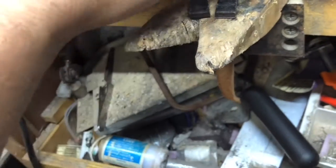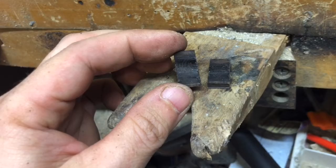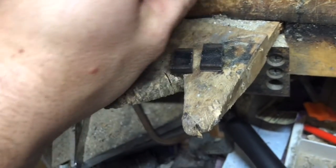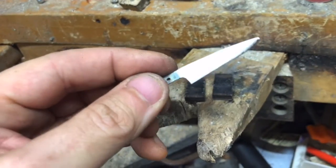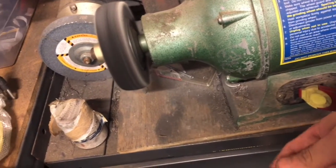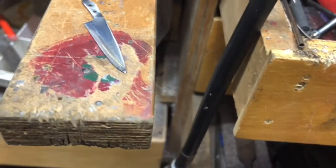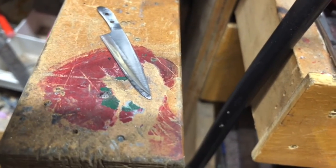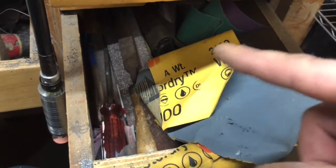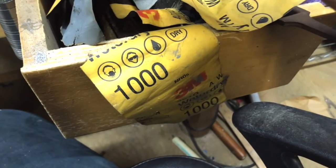I'm going to round off this section I can't easily reach before I start assembling the scales. I'm also going to polish the blade more — I'll take it to the buffer. The scratches I'm seeing mean I want to hand sand it. It's only about an inch and a half of steel, so I'll go up the stages from 180 grit all the way up to 2000 grit.